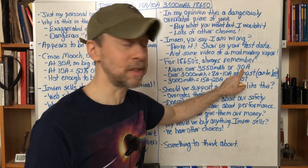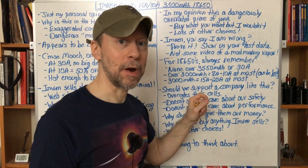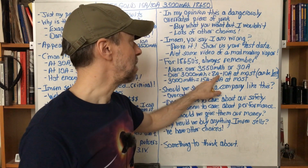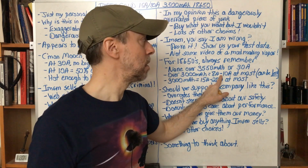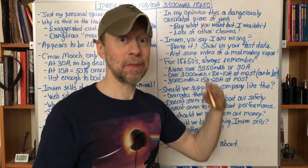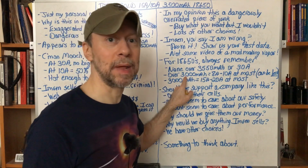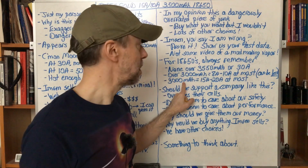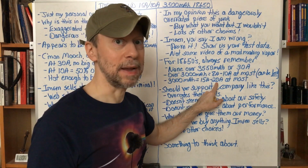Samsung 20S. No 18650 over 3000 milliamp hours, 3100 and higher, can be rated above 8 to 10 amps. That's it. And it can be rated as low as 2 or 3 amps. So namely, it could be 2 amps to 10 amps, but none of them are rated over 10 amps if they're over 3000 milliamp hours. They're not made. If they're 3000 milliamp hours, they could be rated 15 to 20 amps at the most. They can be rated less.